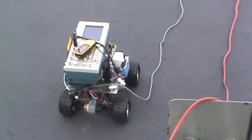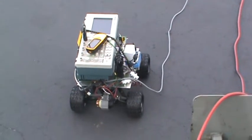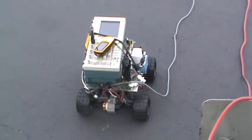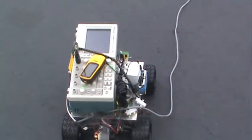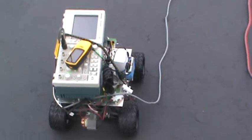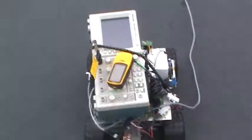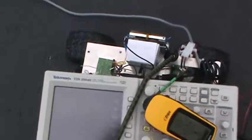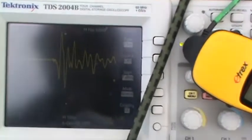This is Mission 11 Experiment 8. We have LowStar. It has an oscilloscope attached to it, connected to the 5-volt rail that connects to the compass. The point is that we can observe the quality of the voltage supply being given to the compass in order to hopefully understand why the compass fails to operate.